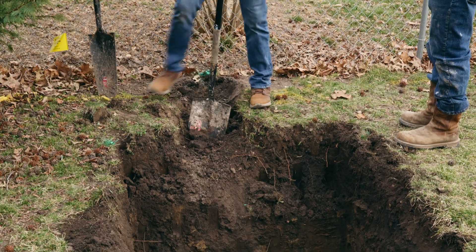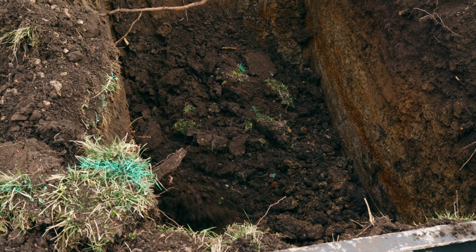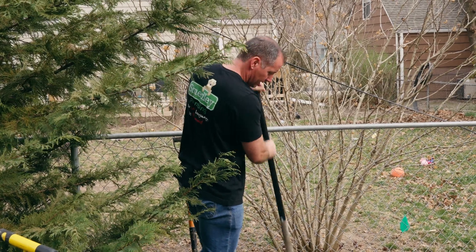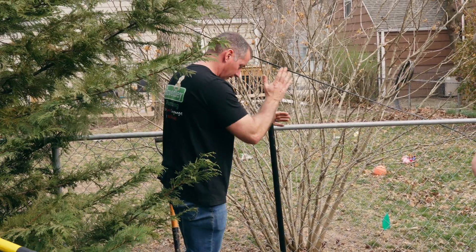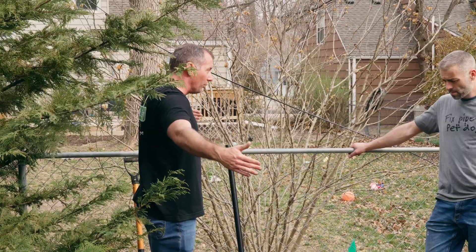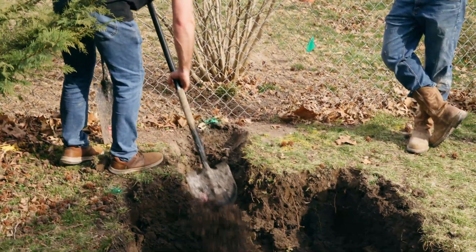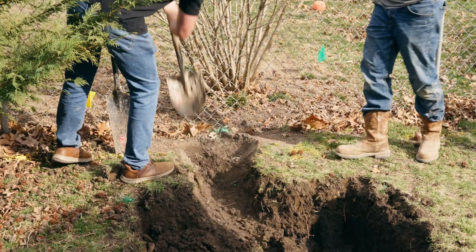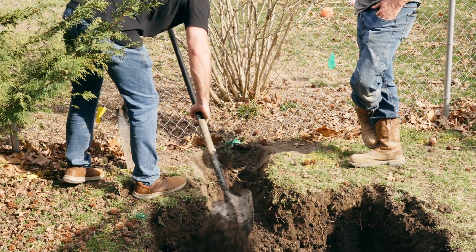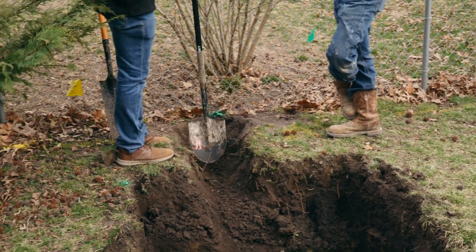You can see how easy it is to dig when we don't have to worry about scooping dirt out of the hole. Clear this height, then come through with the excavator and bring this ditch out to the same width, then start dropping. Eventually we're going to find the gas line in here. They have two feet either side of the mark, so it's a four-foot window with the paint in the middle — plenty of allowance for error. Right now we know this gas line is not within the first six to eight inches of earth. So we get in the excavator, come back through right next to the fence, drop down to this depth. You just don't sink your teeth deeper than what we've cleared, and then you pull it all off into the hole. Then we start the whole process over again.